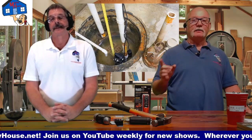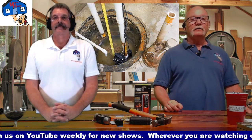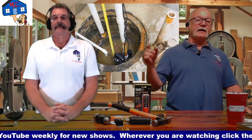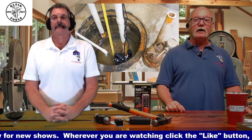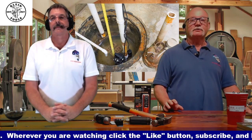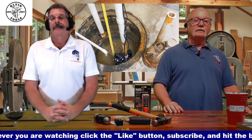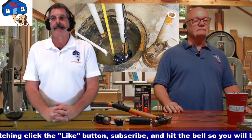So if you've got your sump pump, there's the old one sitting right there, and a brand new one sitting in the hole. So you've got to check that out. You might want to go down and check it, especially if you know rain's coming. If you haven't heard it in a while, just go down and hit the float switch, make sure it's up and running and it works good. Right. If you've got a finished basement, invest in a backup pump.